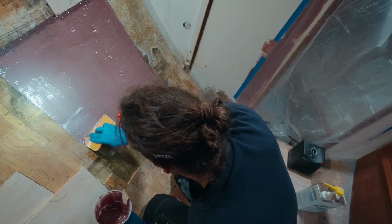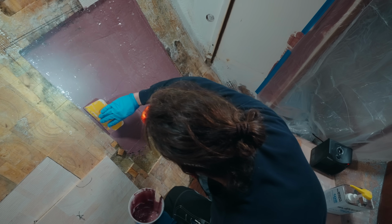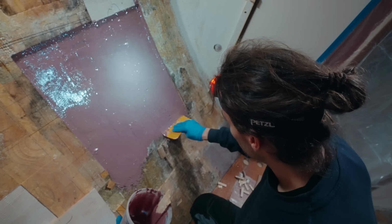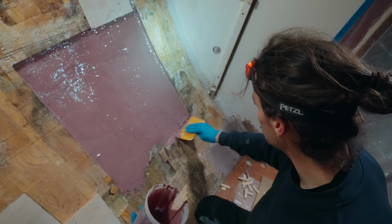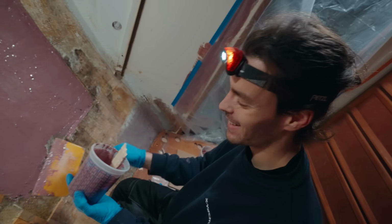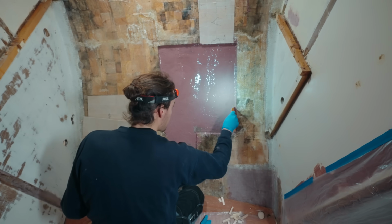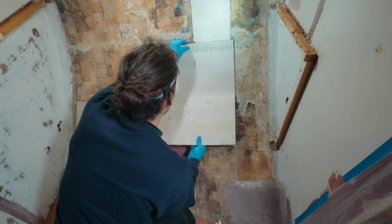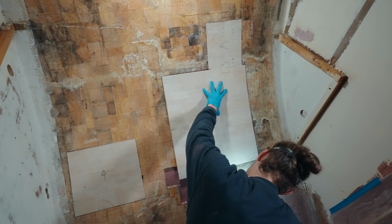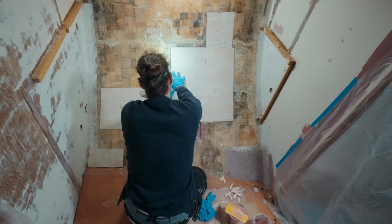And I'm using epoxy, which is luxurious. Usually this is just done with polyester putty. You also, most of the times, combine it with vacuum. But for our purposes, this is much easier now, and quicker, and good enough. We bought these balsa sheets from a fiberglass supply store nearby. They're not horrendously expensive, and they easily bend to the curvature of the hull.